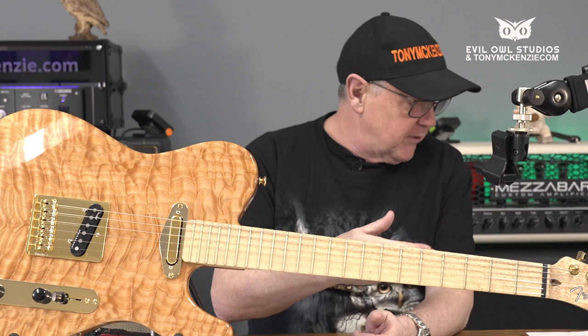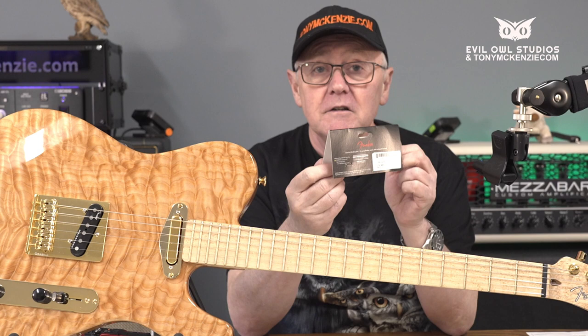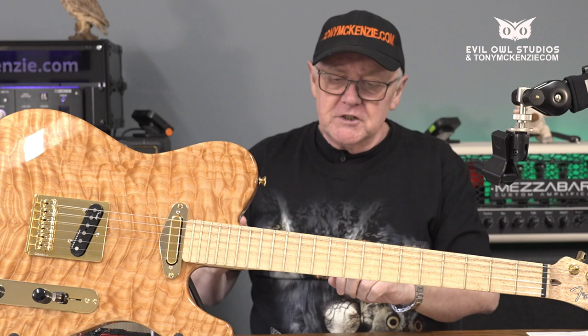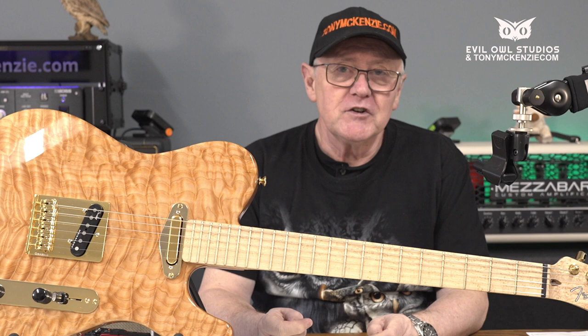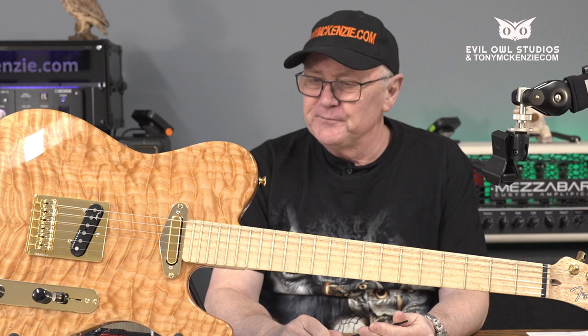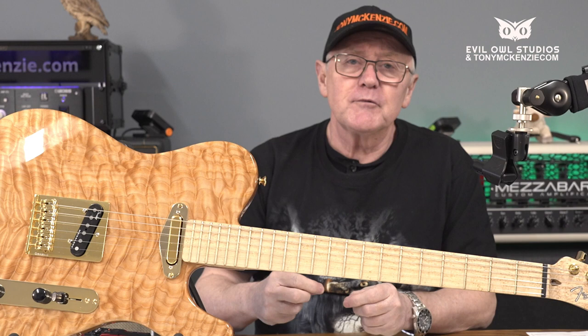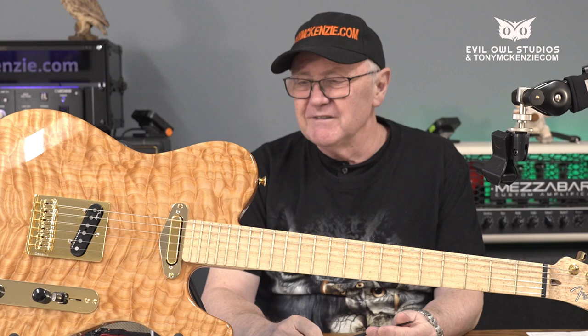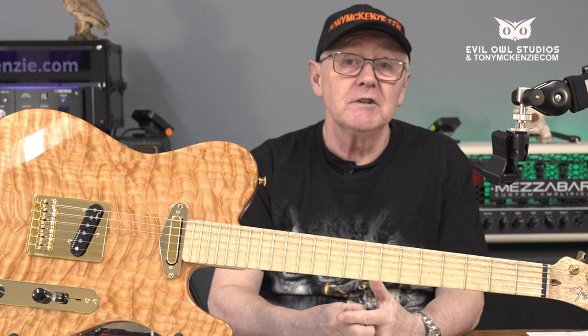Part of rewiring the back was, for example, taking a Fender genuine parts three-way switch and using it. So I fitted that and pulled the four-way switch out. I left the volume and tone in there, the originals, simply because the ones I've ordered still have not arrived, although they were promised by last Friday. Why was I changing them? Well, there's no in-depth adjustment because they have a very tiny shank. It's fine, it fits right, but only just, and I like to have a bit of play. So I decided I was going to change them. Ultimately, I didn't change them because I haven't got the bits.